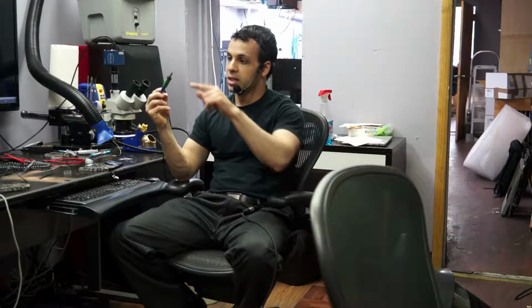You don't have to ask me for the model because I'm going to forget, but they have these on Hakko's website. You can get a tip that bends at the end, and it's really small, and it allows you to get in and actually feel each one of the connections. As you're moving it back and forth, unlike a regular tip, you're going to be able to feel each individual pad, a little bit of feedback as you move back and forth.